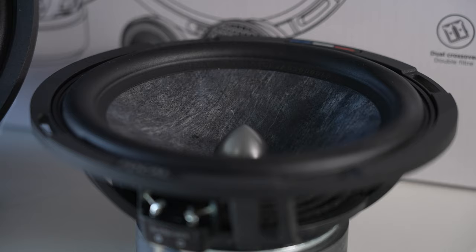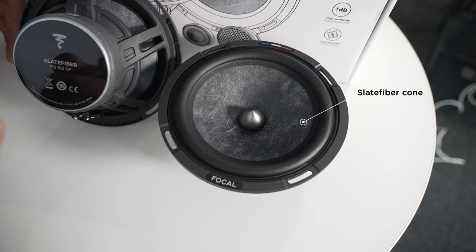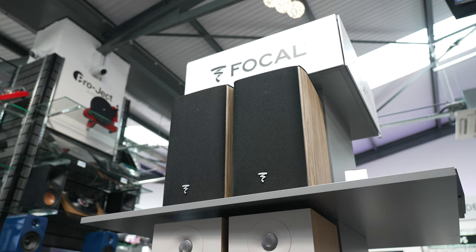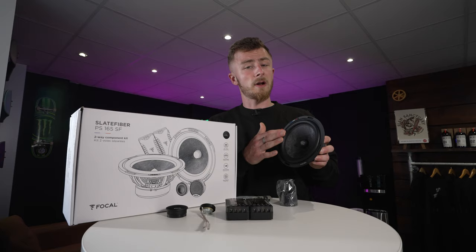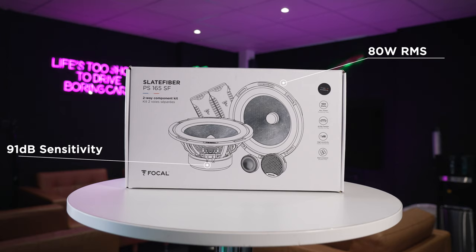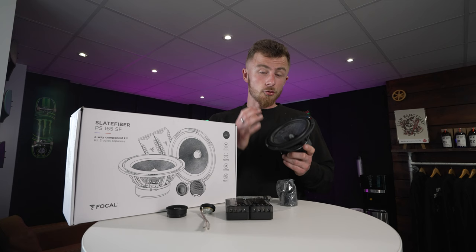In terms of the specs of the actual speakers themselves, the woofer has a slate fiber cone. The slate fiber allows it to be very crystal clear sound — it's very much biased to the SQ side of things, meaning sound quality. Almost like a reference style speaker. They even make these as a home theater or bookshelf speaker on the home side, so these are very, very good. The suspension uses butyl rubber, with an aluminium basket and center cone and a ferrite magnet underneath. These are 80 watts RMS and 91 decibel sensitivity — very sensitive to voltage, giving you very clear, crisp, brilliant sound quality.